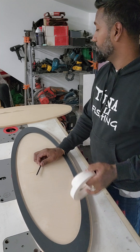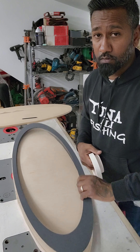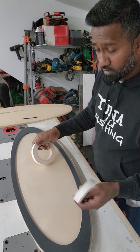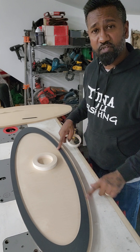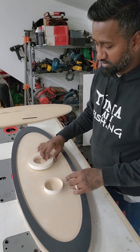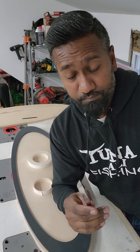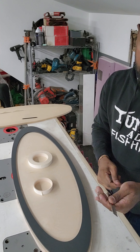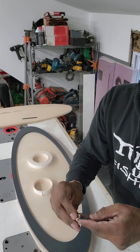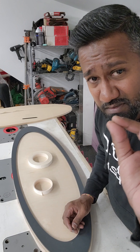Now we grab our template tape — just remember, everything in this video except the wood and the templates are going to be on vexproaudio.com. Grab your template tape, this happens to be three-quarter inch. Figure out the width of the thinnest part of your template material and grab the tape. Most importantly, grab your red dot knife. Let me show you something about this red dot — see that point? It's not a point. Take out the back, there's a little slot, line it up, snap it off — now you've got a point. Just be careful with this thing.